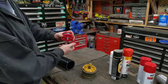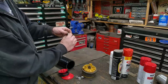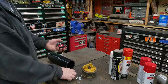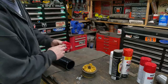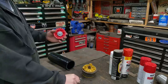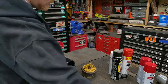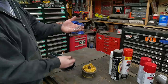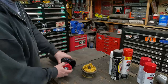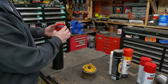We need to do one modification to it. We need to get rid of the big wing nut and a couple of the washers. There's a little rubber washer on top that we do not need, because we don't need this to hold back pressure — this is meant so plumbers can test the pressure of a piping system to make sure there are no leaks. Then we're going to take a flat washer and instead of the wing nut, just use a 5/16th nut. The parts we aren't using from the kit are the wing nut, a rubber washer, and a little nylon washer. We want that nut to spread the load on the plastic. Then put it in the end and it will self-locate over a great distance.